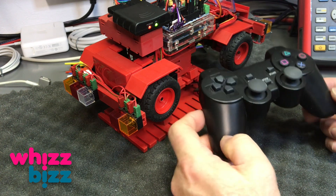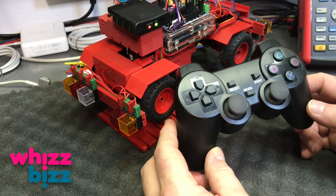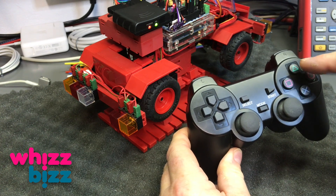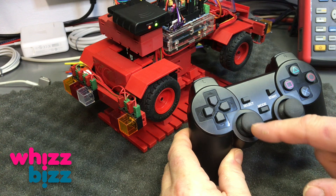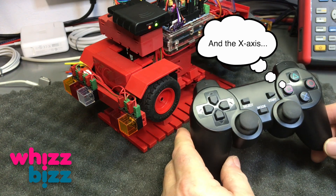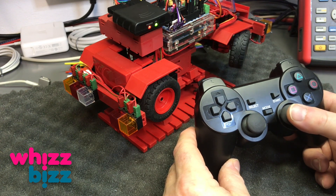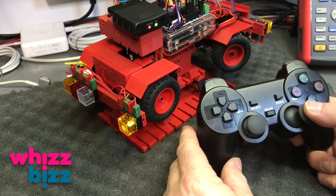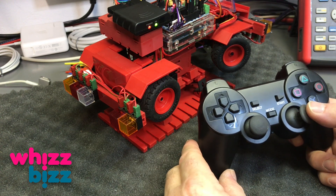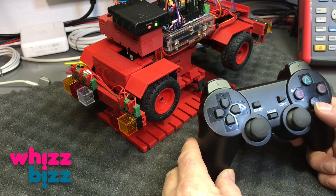So let's see what we can do with it. There are 12 buttons available — I'm not using them all for my project at the moment, but I made use of three buttons, the X axis of the left joystick, and the Y axis of the right joystick. First of all, steering: as you can see, it steers quite well, proportionally and analog. And I also made direction indicators, so you can see them activating on each side — the steering works great.